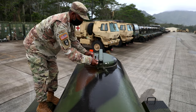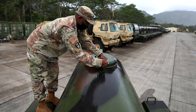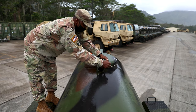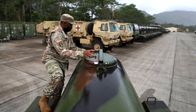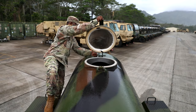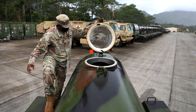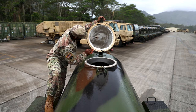We'll check that the back locks are working — those are important for safety. You can lock the manhole cover in the down position and also lock it in the upright position, so when you're cleaning the inside there's no chance it'll fall down and hit you on the head. We'll also check the front latches to make sure they properly secure the manhole cover, as those can be really rusted and inoperable. We'll open up the manhole cover, put the secure back lock in, and check the rubber gasket lining to make sure it's intact so that when sealed, no outside contaminants can get in.